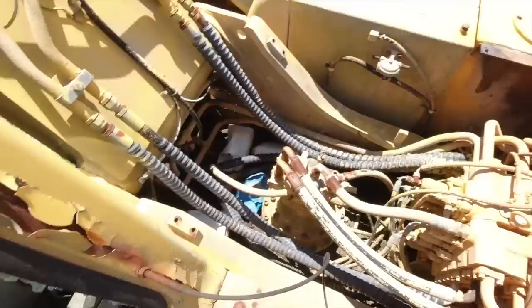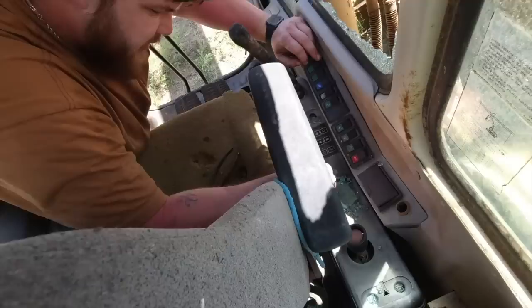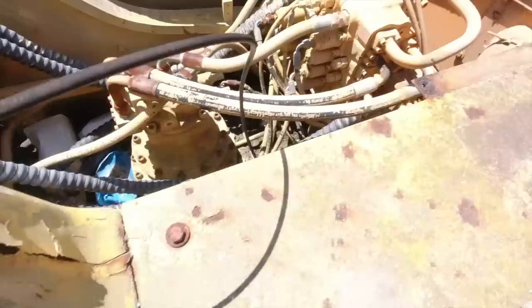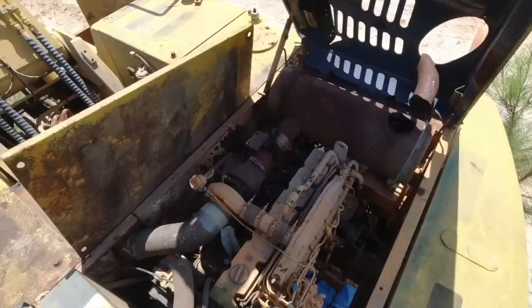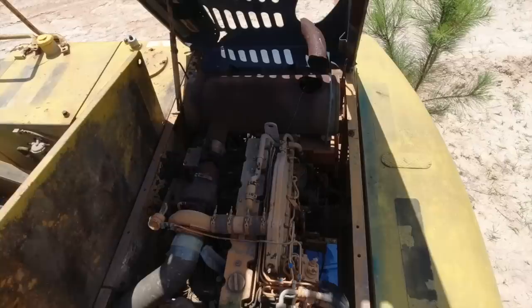All right. There it goes. Hold on. So it looks like we got a glow plug heat here too. I don't know how it works on the switch because everything's loose. It looks like it's supposed to turn back a notch for the glow plugs. But the switch won't turn back. I think the switch might be froze up for the glow plugs. So we might just have to use ether as glow plugs. Seriously, it could be a bad hydraulic pump, so we get it running and see if we can track it down. Well, she sounds like she wants to go. I'm warming up the glow plugs.